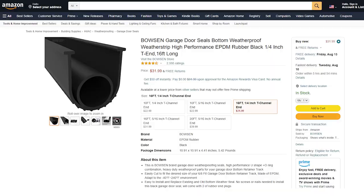You can use fiberglass, spray foam, whatever. Then you can spend some really exciting time checking for gaps in your seals. These doors are a little different than normal garages and basements — they're built out, filled with insulation, and then sealed up. You want to check underneath for gaps, check your weather stripping around your doors, and check your garage door bottom seal. It's really easy to replace and fix. And simple things like adding flooring will make it feel like your concrete is not 11 degrees.